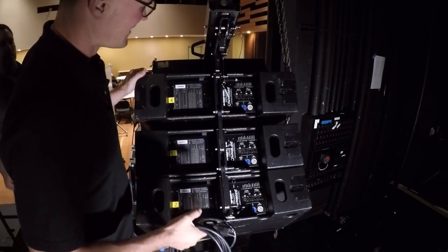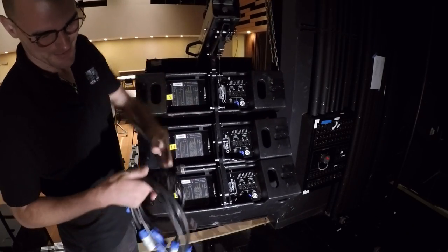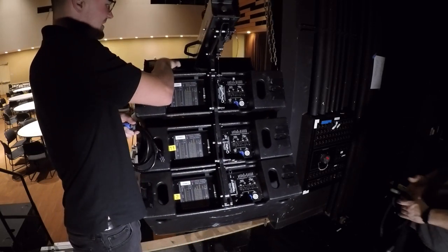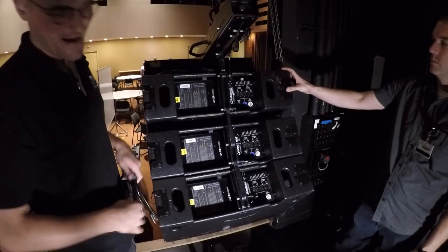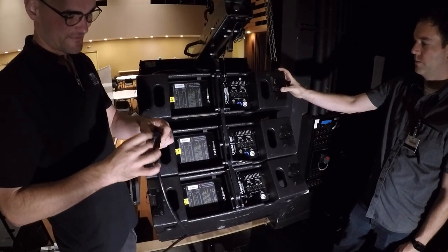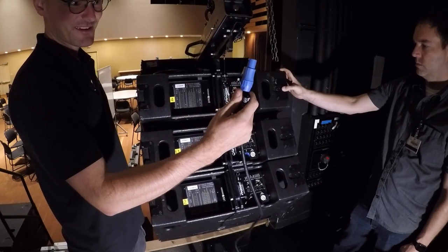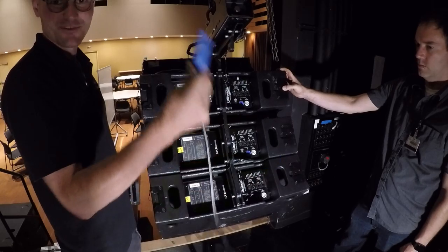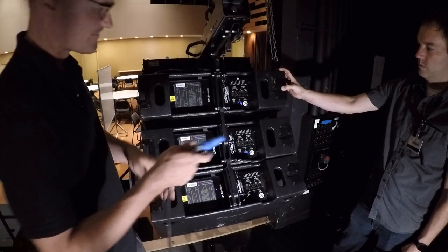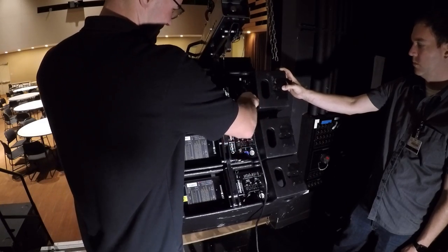So now that's up in the air, we can put two boxes per circuit, which means we can link them together for power. So I'm going to get Q-Bert, which is the square box that lives in the cage — that's got all the stuff for these and the subs. I'm going to hook this up. It's called the PowerCon cable. It's sort of like our SpeakOn cables but it's for power. It's got different notches in it so you can't accidentally plug it into a speaker input. That sucker just goes in, boom, twist it.